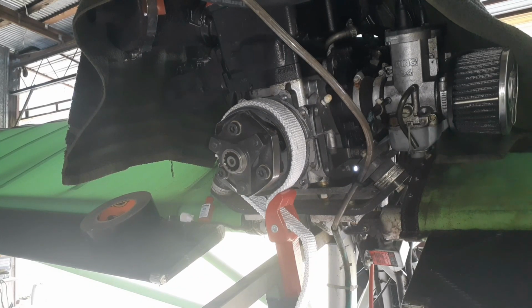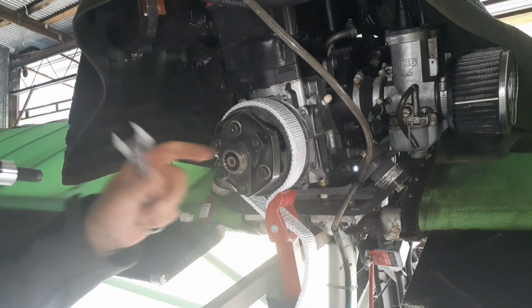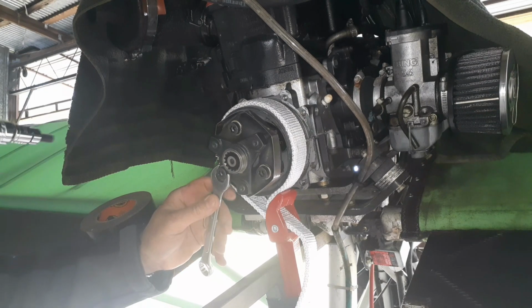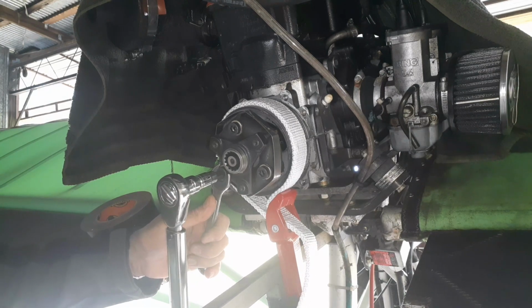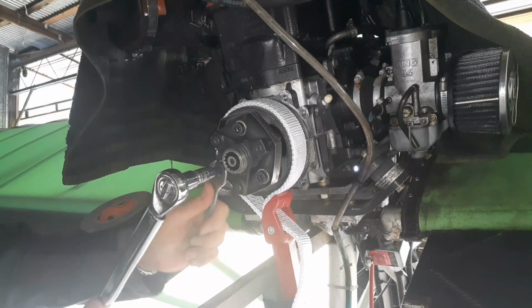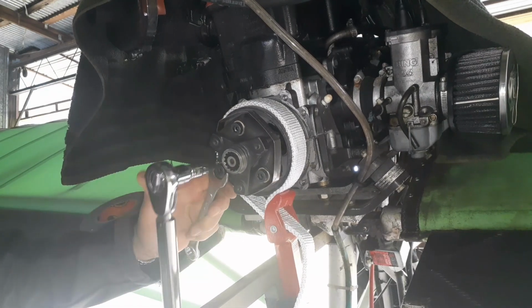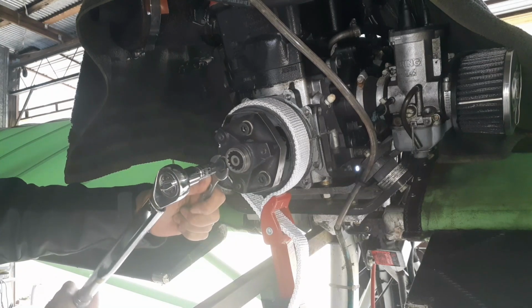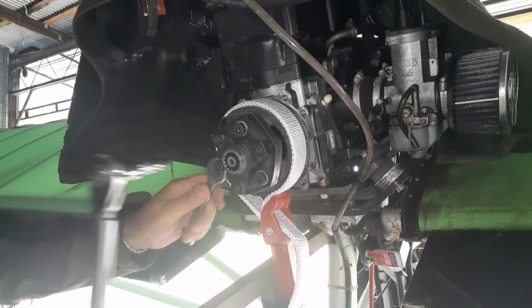All right, so let's give this a try. Flip the strap wrench over the other direction, got my 3 bolts in with Loctite, and the instructions say to hold the washer with a 17 millimeter wrench. And let's get it over the washer. And these get torqued to 30 foot-pounds, as the strap wrench slowly grips.